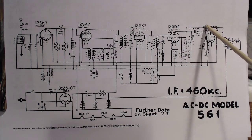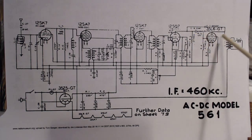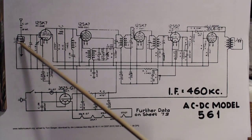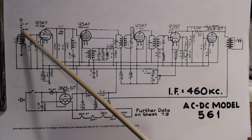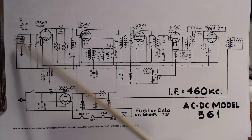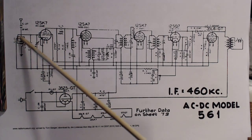There's some feedback - pretty sure that's a little bit of feedback which will control distortion just in the output circuit. There's the antenna - you can make a connection to an external antenna. There's a 0.01 capacitor there for safety purposes, so if you get a shock it's a small tingle, not a big whopper. That's the loop antenna.